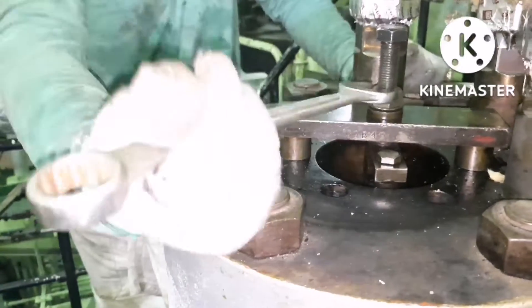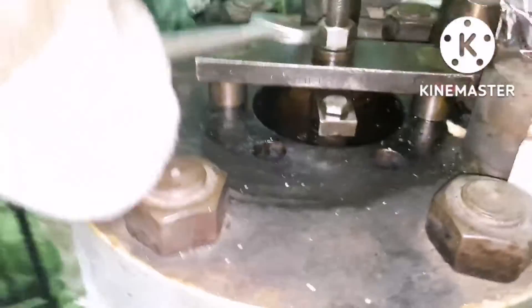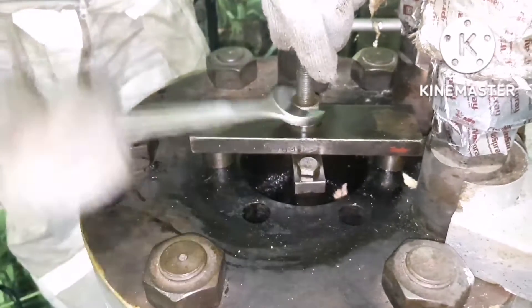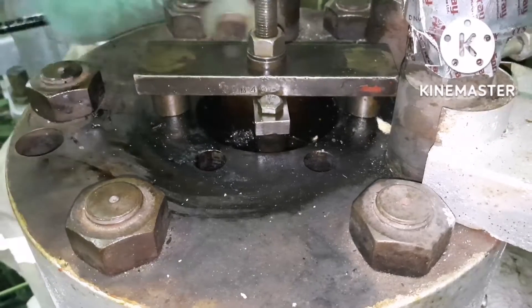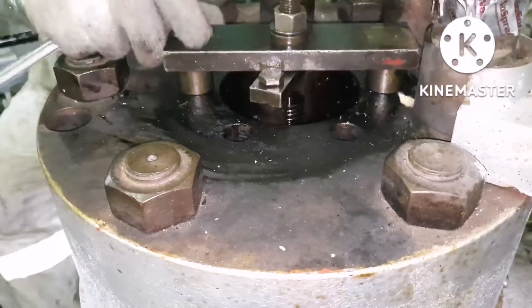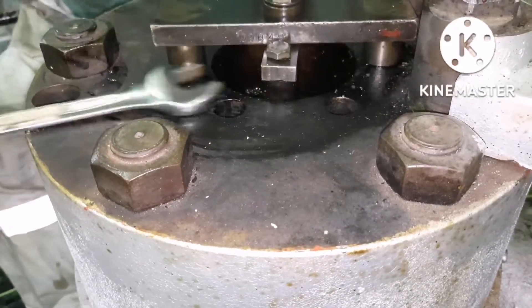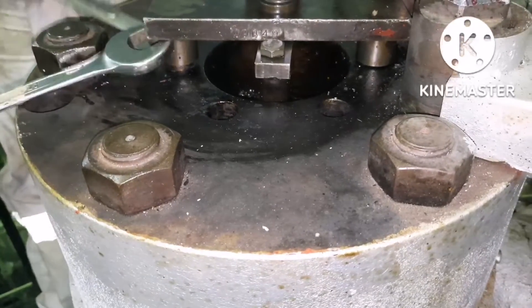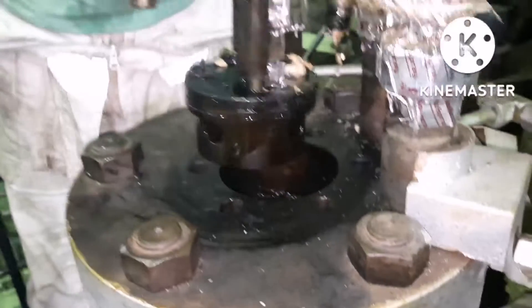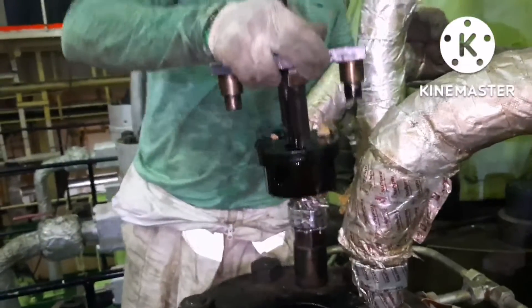The reason why we use the tool is because we are using heavy fuel oil, which tends to cause jamming. To ease it up we use the jacking tool. Before removing, you can even put some diesel oil on the side of the suction valve to give additional support for easing it out. Once jacking is done you can see the suction valve is loosened and turning. Just give it a jerk and it comes up — that is how you remove the suction valve from place.